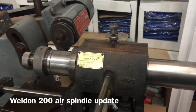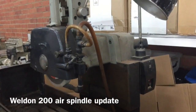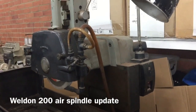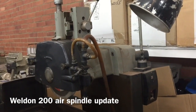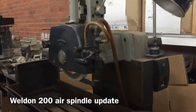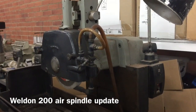Taking a segue across to the Elliott surface grinder - this particular 820 had an option of an air spindle for mounting the actual drive shaft, which would have been quite a nice option. Essentially no wear, no heat-up time. Typically when you first start up a surface grinder you need to operate it for a little bit of time to get everything bedded in and at temperature, and you'd normally keep things running while you do all your setup. With an air spindle you don't have to do that - you can just be on and running straight away.